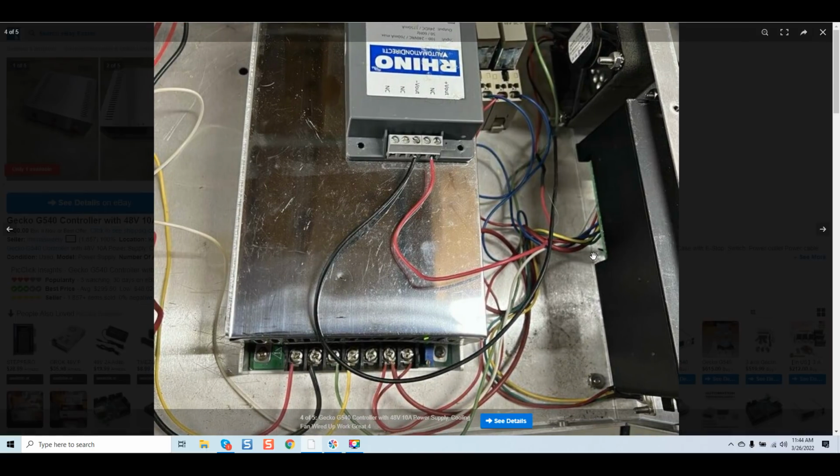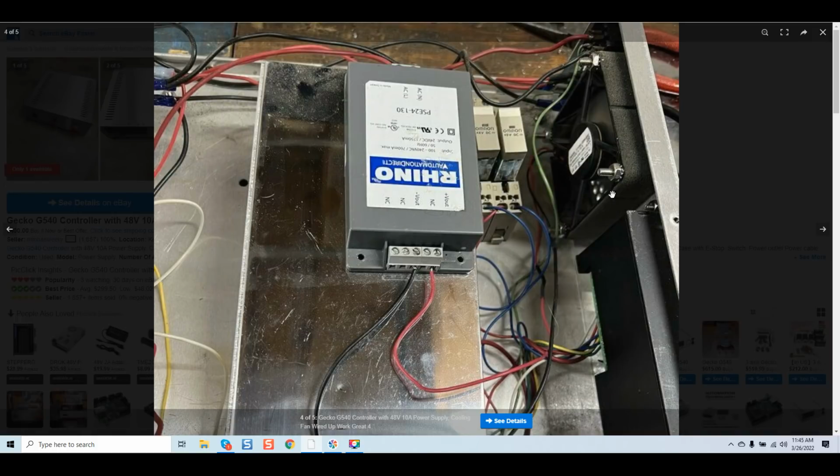But either way, optimally, just like a PC, you'd have a heat sink on the processor and then a fan to cool those heat sinks, because once again we've utilized a larger surface area giving you better cooling, and then of course using the fan to actually dissipate the heat even more so. That's the right way to do it, done in whatever format he decided to go with, but again, not best practice overall for the driver longevity of components.